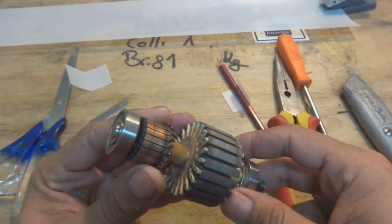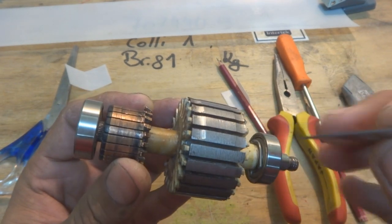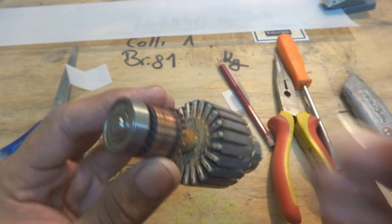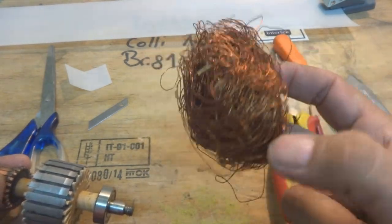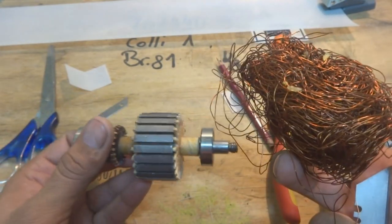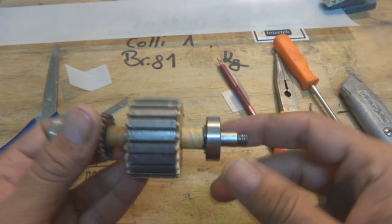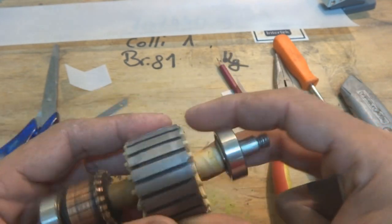Rewinding an armature. As you can see, this armature had been cleaned from the inside. When you get such an armature, there is old winding which is burnt, so you have to remove that winding. The old winding, as you can see, I just removed it. This is the old wire — all of it was wound inside this armature, just like a ball of old wire.